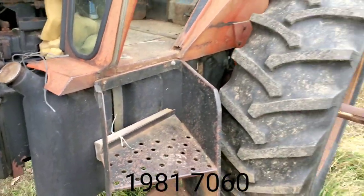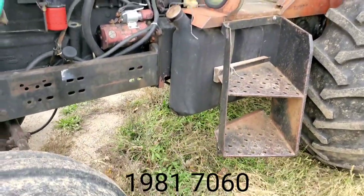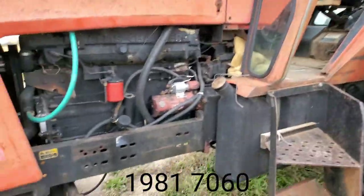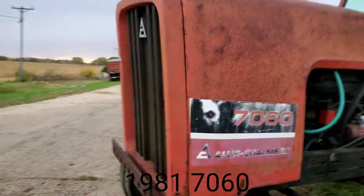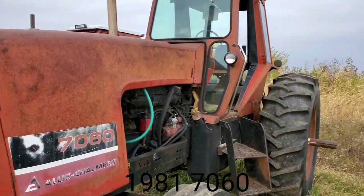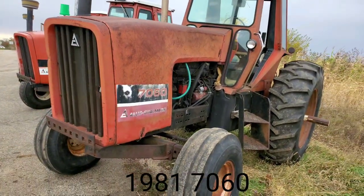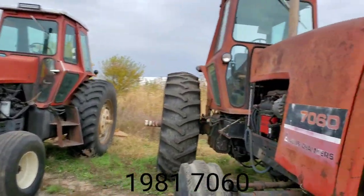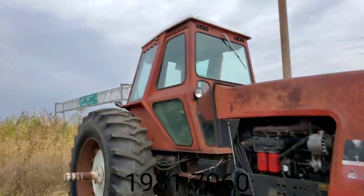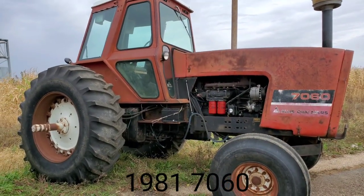This thing was a rusty mess, but the rear end in it is really strong. It seems really good. Doesn't do the knocking. By the time I'm done overhauling it, we'll have less than what the tires are worth into it. So I figured it's worth overhauling. Right now it's got about 90 horse if it's lucky. Pump is set at 192. And I'm not exaggerating, either, 90 horse. Hopefully by next spring though, I'll be showing you videos of this one running strong with the plow.